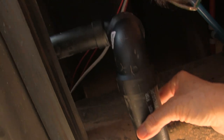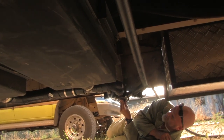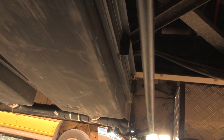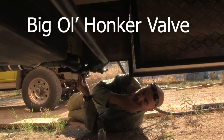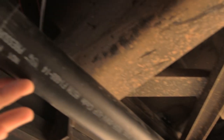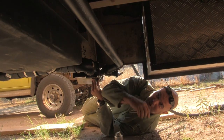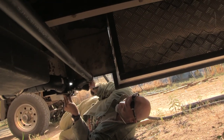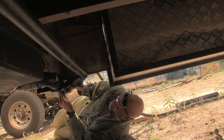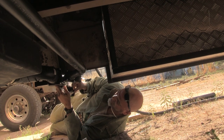This is epic. Like, this is a really cool thing we did here, and we did a pretty good job. This is the letting out of the gray water. What this is doing is when we can, with our big valve, we can choose between going from our wastewater going into this tank, these tanks, I should say, these are our gray tanks, or we can divert our shower and our washing machine out this pipe, and it comes to this valve right here. And if we open this valve, and I'm sure most people have seen these before, this is just the cap to our dump orifice here.